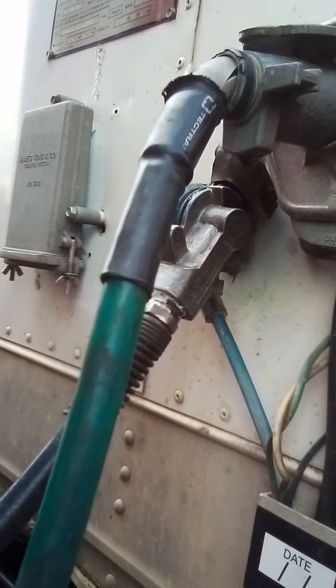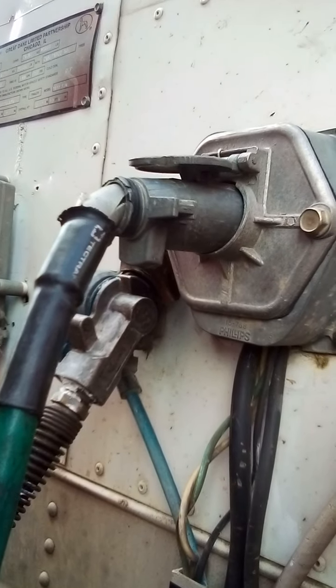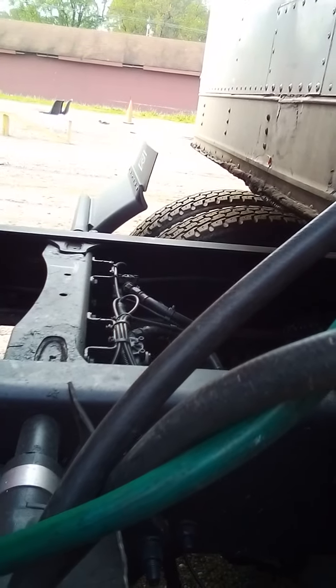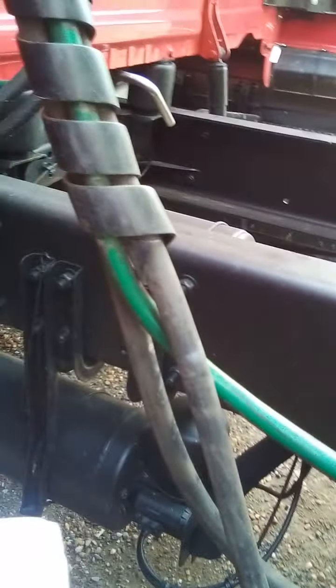Your electrical connectors: check that the trailer electrical plug is firmly seated and locked in place on both trailer and truck. Electrical lines are not tangled, crumpled, pinched. Electrical insulation is not cut, cracked, shaved, spliced, taped, worn, or being dragged on tractor parts.